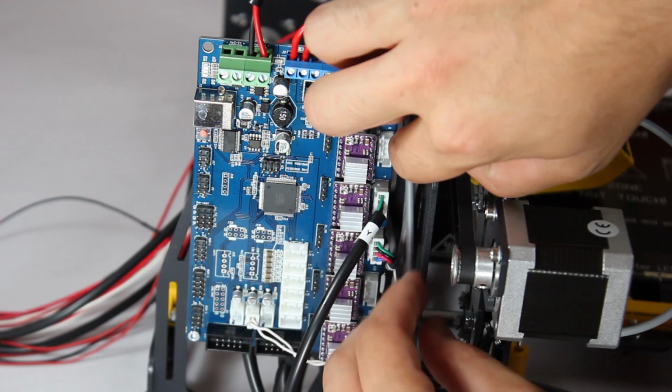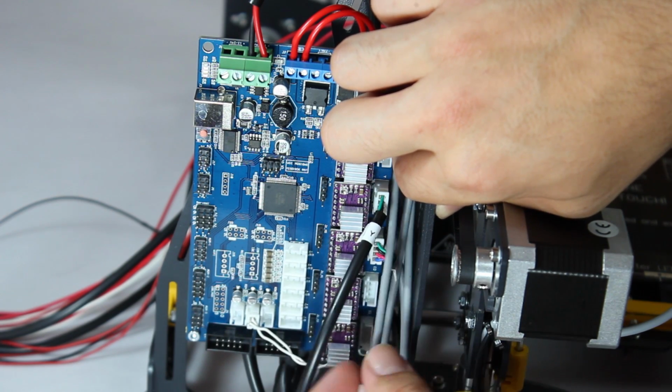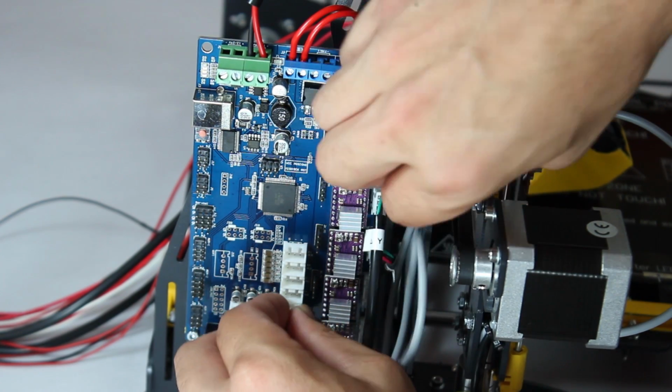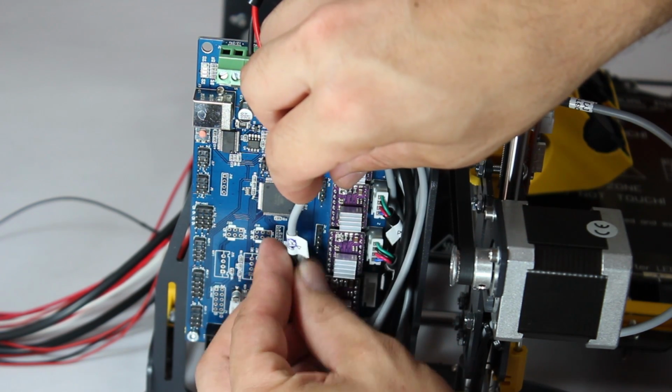Bunch these 2 up with the remaining end stop cable and the Z-axis stepper motor cable and insert them between the motherboard and the frame as seen here. Pay close attention to the user manual to connect the cables properly. The cables connect to the slots with the corresponding letters next to them.